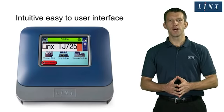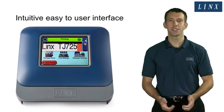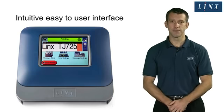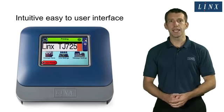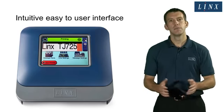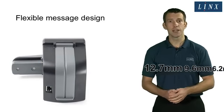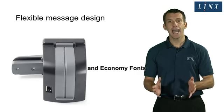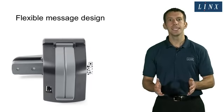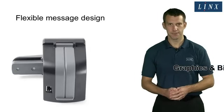The TJ725 controller has a full colour touchscreen interface for easy message creation and operation. No need to purchase a separate PC to generate your messages. The "what you see is what you get" display allows you to see exactly what you are printing. Print with a range of resolutions and font sizes. Design messages without restriction, placing text fields anywhere within the 12.7mm print height. You can even add your own logos and images by importing them through the USB interface.